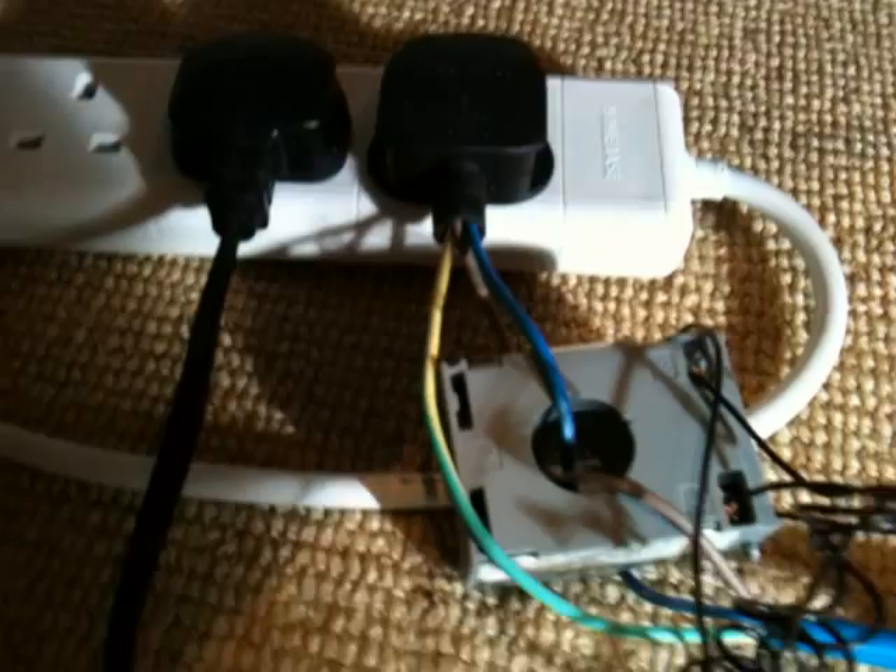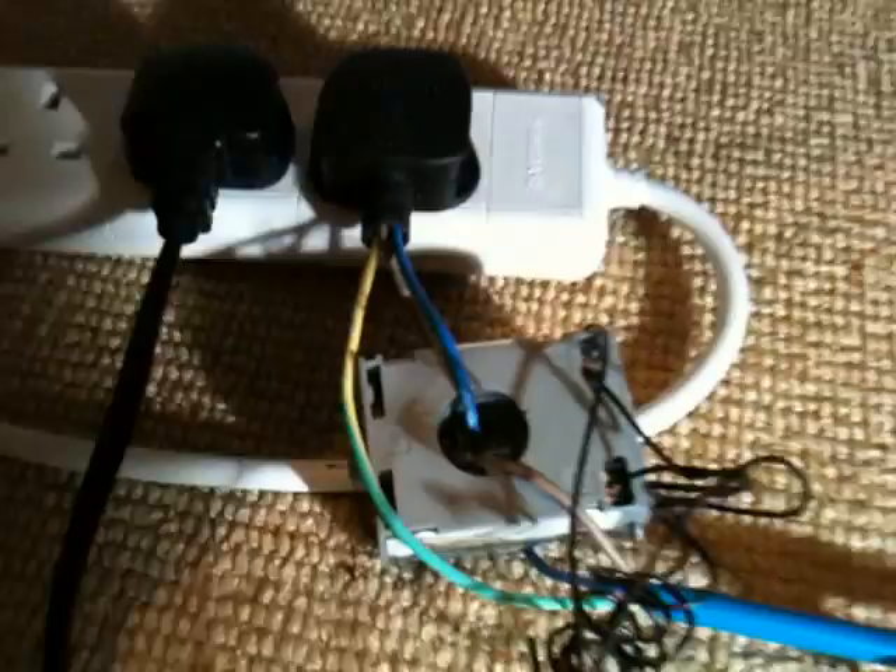They're passing in opposite directions in order to get two turns on the core — it's simply a practical issue. I didn't want to have to cut the cable and wrap the live round twice, just to keep it symmetrical. It's ballasted with this coil of wire here, and there are some potential leads coming off here which disappear off into a wire spliced into the input of my sound card.